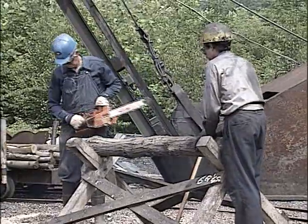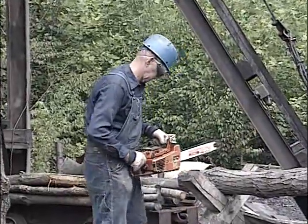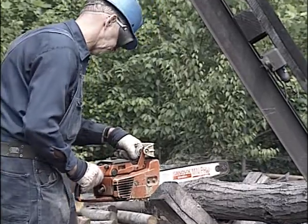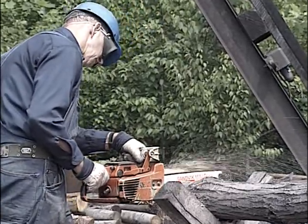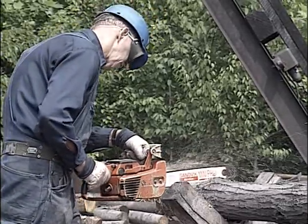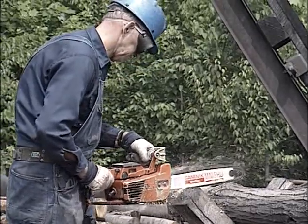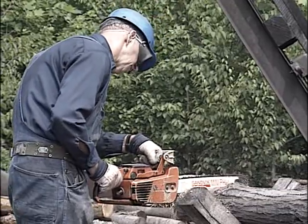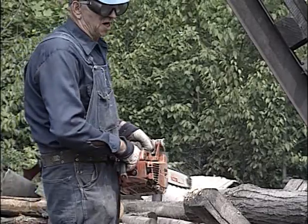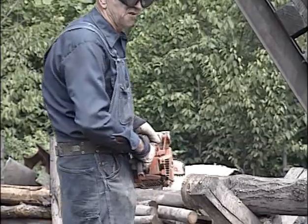The first cut was to saw the piece of timber to the proper length. The second cut will be that which is remaining on the collar between the notches. Again by eye, Buzzy is sawing three or four saw cuts into the collar, which then will be split out with an axe to create the notches.